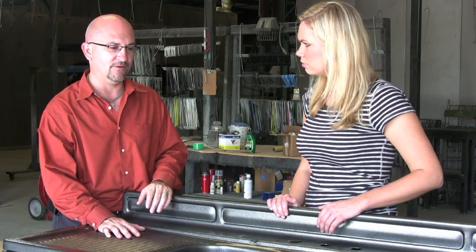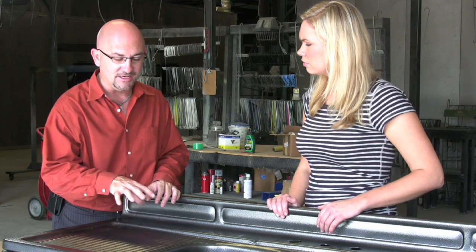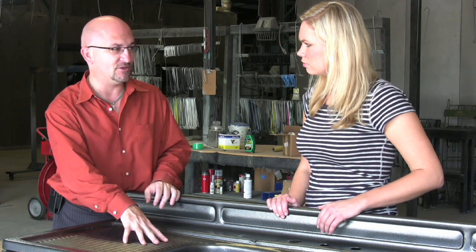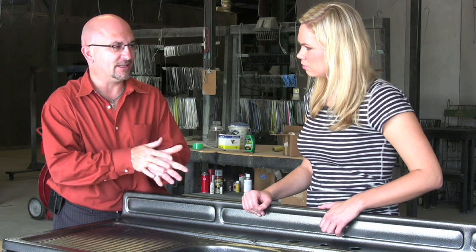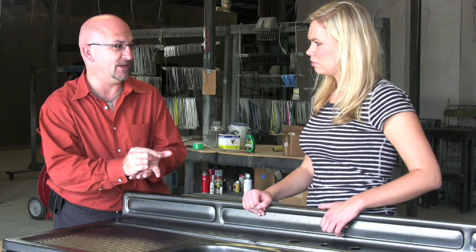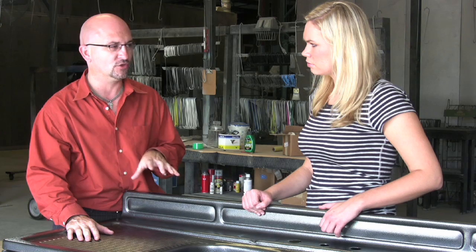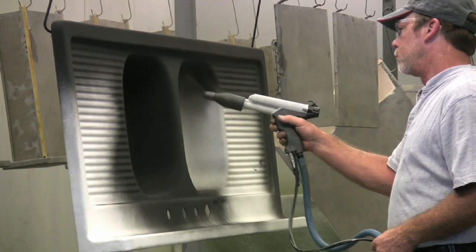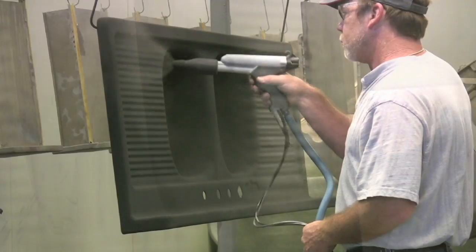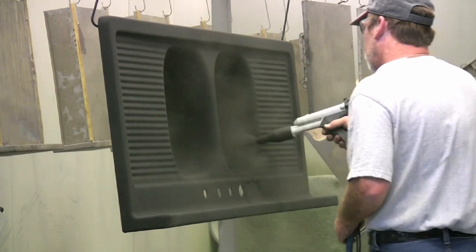It would have been a very, very hard process to take all of it off. And to be quite honest with you, there was so much damage to the top as it was. The porcelain actually adds a strengthening element to it, and it adds some thickness as well. If we'd have taken that all the way down to the metal, I think the metal was probably in such a poor shape that we would not have been able to salvage it at that point. So we were lucky in the fact that it was actually porcelain. We sanded it down and smoothed it down, and then we were able to powder coat right over the top of it.